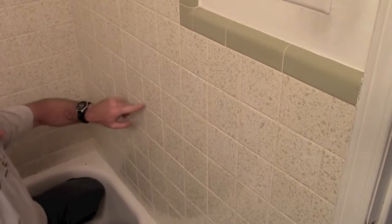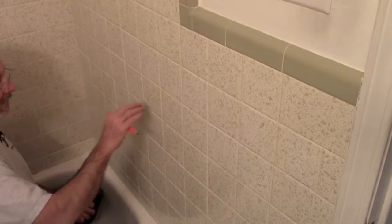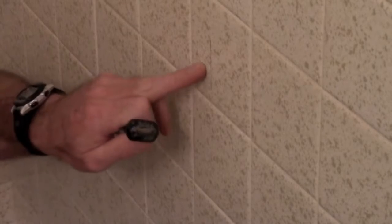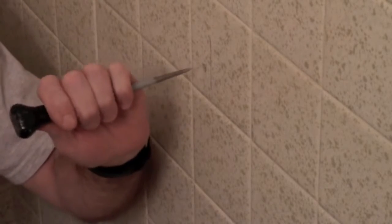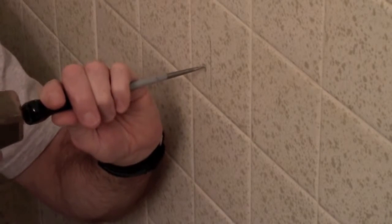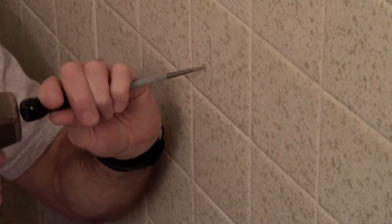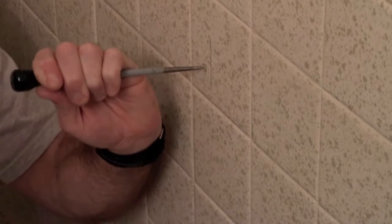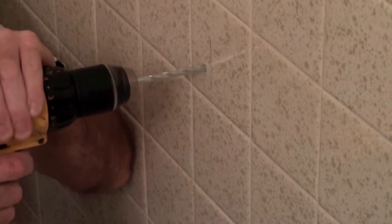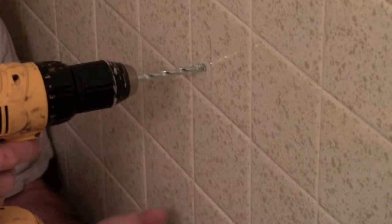Pull the bar off and drill that one hole. First, it's a good idea to get some kind of indentation started on this smooth tile so the drill bit won't skate around. You can use a nail, a screw, or anything — I have a small awl punch here. You just want to barely get something started — not too much, or you might crack the tile. Then take your time with the drill bit and let it do the work slowly.